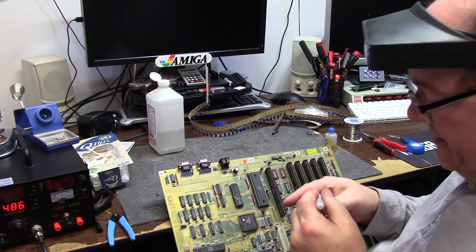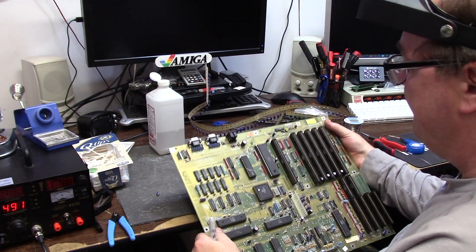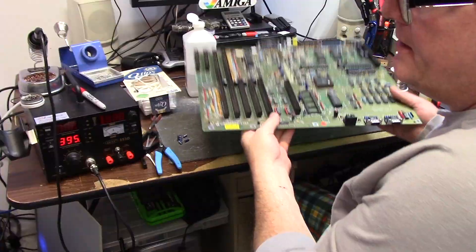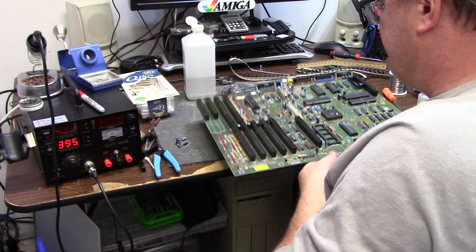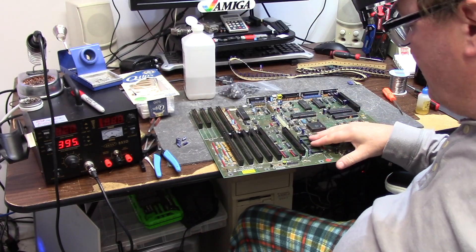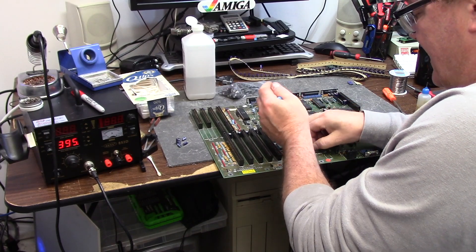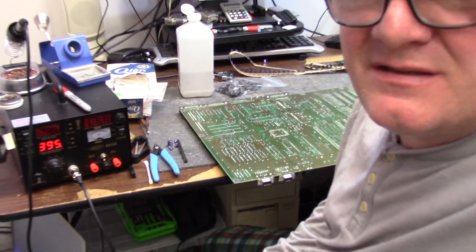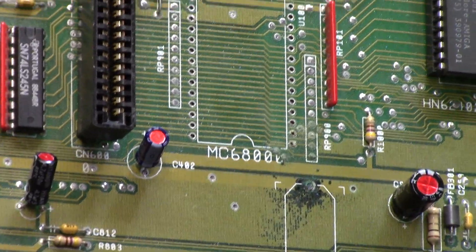I put a red circle with a Sharpie on a cap that I've replaced so when I go through the board I know where I left off. It's 9:05 a.m. Tuesday. I'm going to do the CPU socket — you can see on this side it's got some green, so I'm going to snip it apart and pull it out. This board's in good enough condition I could go underneath, but I always just clip the socket out. It makes removal a lot easier and comes out really clean on a non-damaged board. It's sure nice working on something without acid damage — using actual solder instead of the concrete it turns into.